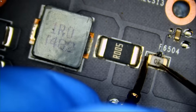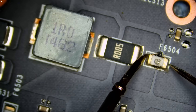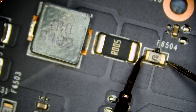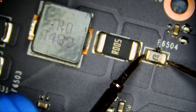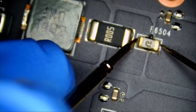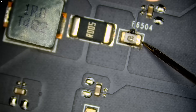Let's start with the fuse. Is it continuous? Meter in continuity mode — measure from here to here. We're reading 0.097. That's weird; we should read zero. In diode mode we get 0.110. Let me test to ground. If we go here to ground, we have a fluctuating reading: 0.20, 0.30, 0.21, 0.24.